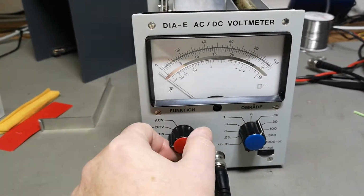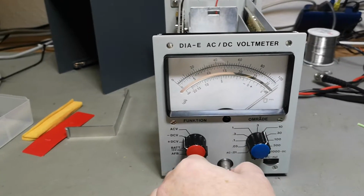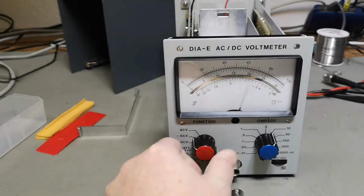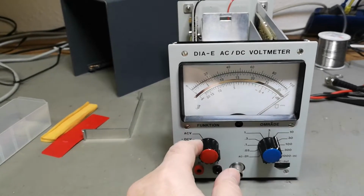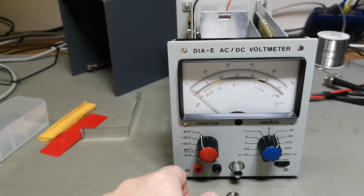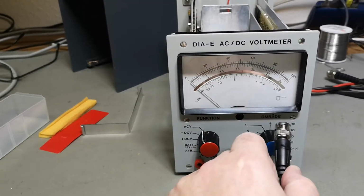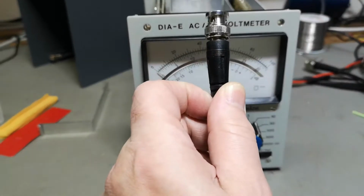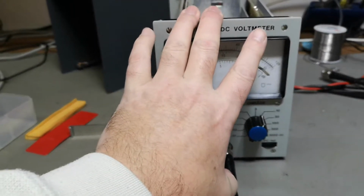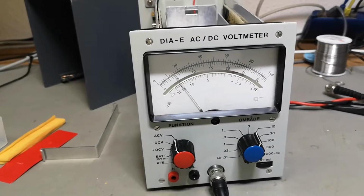So this is DC positive, and that goes negative, and DC negative, that goes positive. And I don't have any DC voltage here, I got AC voltage here. And the same happens, right? So there's a DC offset kind of thing, but when I go to AC voltage, it goes to 0, right? And this is 10 volts RMS, I would imagine, full range, right? So in this one, I got 1 kilohertz, 3 volt RMS. Okay, if I click that here, that will be the case.